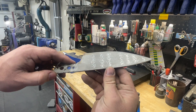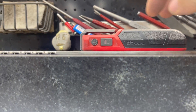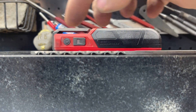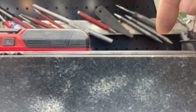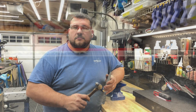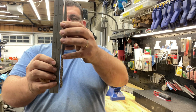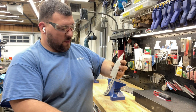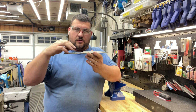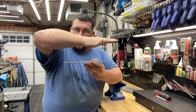As you can see, I started going up, kind of just working it to get that banana shape out, and as you can see here, the whole knife is pretty flat now. The straightening hammer got this back straight — we're now straight enough to go on the grinder and it'll be a great blade for somebody. As we straightened that curve out, we forced the material out on this side so it brought it back down straight.